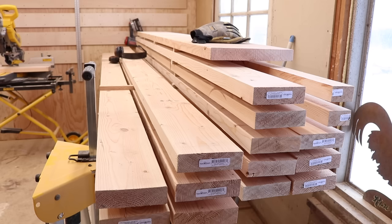On your lumber — I've got mine brought in here and stickered, meaning I've got three-quarter-inch strips of scrap plywood in there to get air circulation around it. In a perfect world, this would have been brought in and heated and sat for about a week, or two weeks would be even better, to climatize and dry out. Yes, it's kiln dried from Home Depot, but it's still got a fair amount of moisture in it. I'm an impatient person and I don't plan very well, so I'm going to build with it. But if you're thinking about building one of these, get your material now, get it inside a heated space, get it drying and warming, and make sure you sticker it like this.